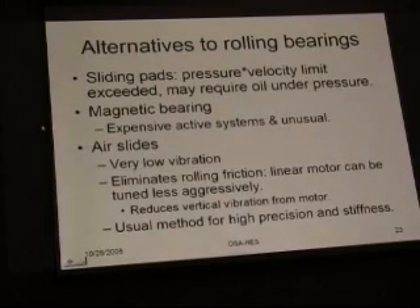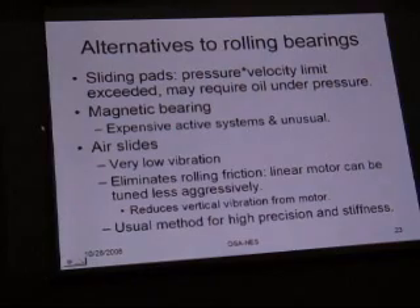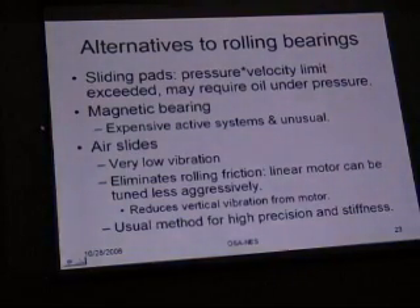The air bearing is smooth, low friction, stiff — it has everything we need. It also averages nicely over its whole surface, especially for the graphite air bearings. Furthermore, it can be built for a reasonable amount of money. We initially thought we were talking many tens of thousands — or $100,000 scale for a piece of glass made by optical fabrication means. But then we learned that the way it's done is with granite, and the granite industry can just meet that spec. So we're in business there.